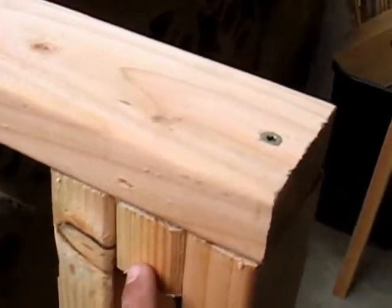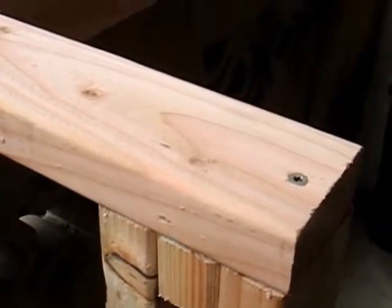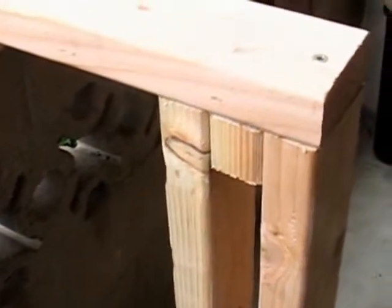So then we've got 2 legs, but they're actually going to get beefier than that. Okay, this is the left leg. It's slightly cockeyed, but you can see basically I'm going to have 2 verticals, and then I'm going to have a horizontal right where this little piece is here. This is actually just a scrap that I'm using to do the spacing. I'm going to take one of the 4-foot horizontals, and run it all the way across to the far end. So each leg is doubled up, and it's going to have the same arrangement on the bottom too, which will make these incredibly beefy and barely able to move with all the weight on top of them. Granted, I could probably put a brace from the wall to the leg, which would keep me from being able to kick it. But anyway, here's a little tip. You can use a scrap of wood to do your spacing.